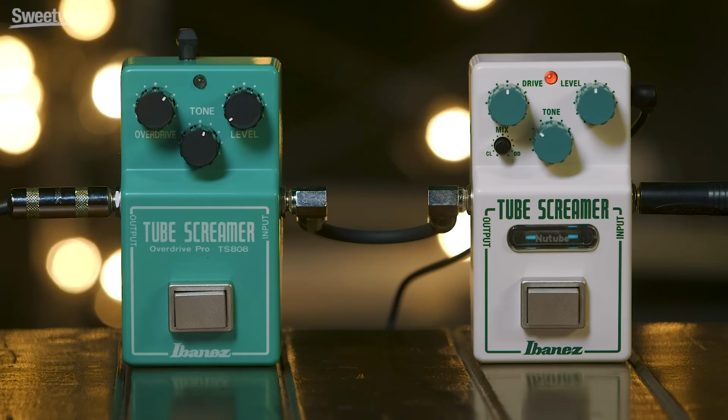The Nutube was introduced in 2016 by Korg and it was used in their MV line of amplifiers. The Nutube is basically a vacuum fluorescent display that functions as a vacuum tube, but it has some big advantages over a traditional vacuum tube. For example, a traditional 12AX7 vacuum tube, like you might find in a pedal, uses about 100 volts of power, requires 2 watts. And it'll last for an extended period of time, but certainly not forever.